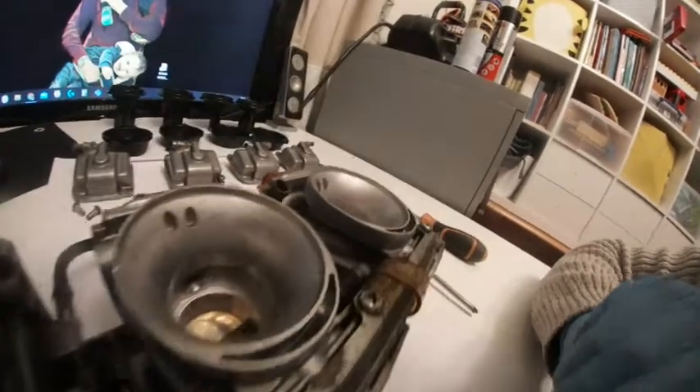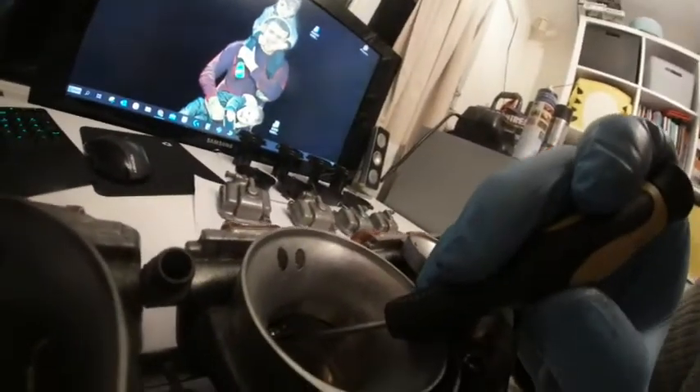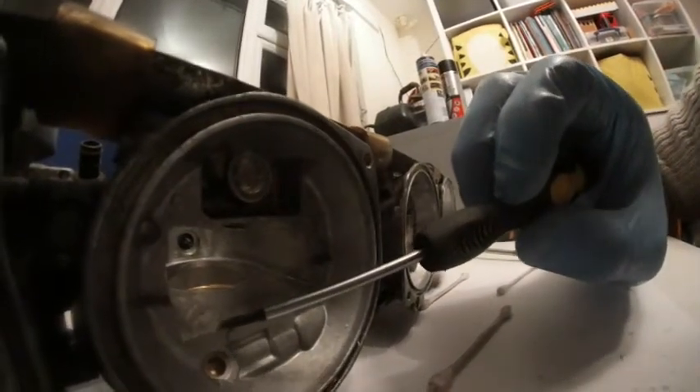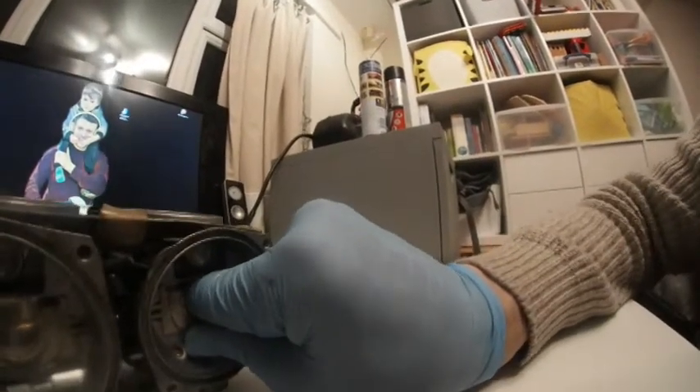There is none of it here, and none of it here. I can definitely feel it when I screw it like that. The casting is not in soft aluminium. Finally I discovered what the issue is — it's all about the casting. This casting at the bottom here is a tiny bit rough in comparison with all the others, which are nice and smooth.